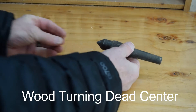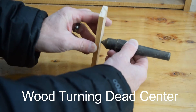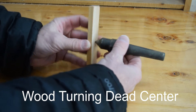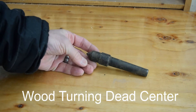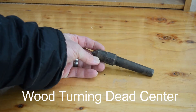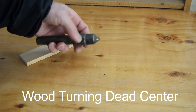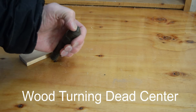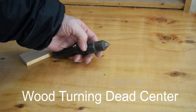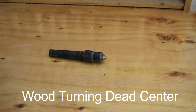The idea behind this is you put the wood up against it, and the wood will be held in place, but the wood will rotate against the dead center and cause friction as the wood's turning. It's not really an ideal thing to use, so I don't use this at all — you can see it's just kind of rusty and old. The opposite idea is to put it in the lathe motor side and have it drive the wood, but there's really not a lot of friction here, so it really wouldn't push the wood. You'd be susceptible to the wood just stopping spinning all the time and getting frustrated, so you'd need a different spur drive.